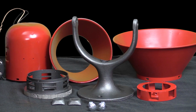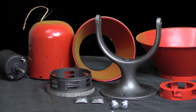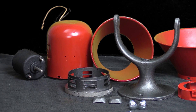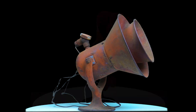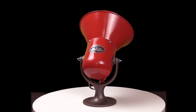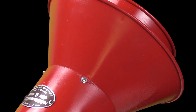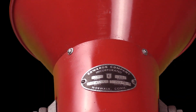We got the siren painted and now we're ready for assembly. Removal of the rust, corrosion, and paint was the perfect application for the laser. It was a dry process and did not use any chemicals or abrasive media to remove the surface layers. It is safe to use on metals such as aluminum and brass, so we had no issues when we came across the different materials used in this World War II air raid siren. The laser left a smooth, clean finish that was immediately ready for paint. It runs off any standard 110 volt outlet, so the overhead to operate it was extremely low.